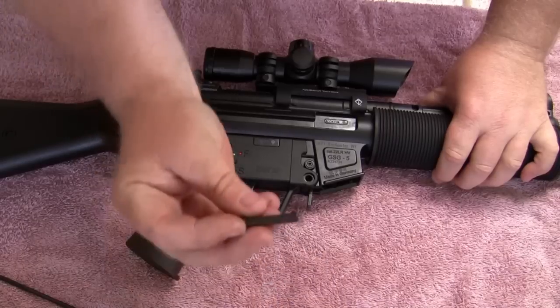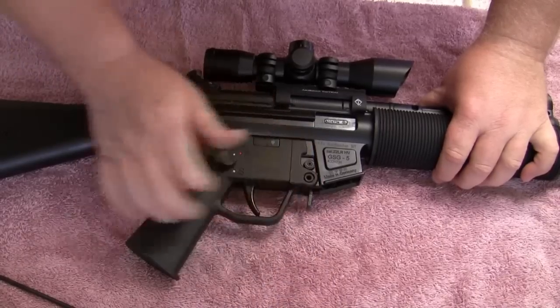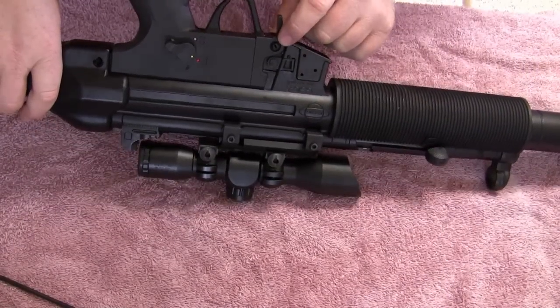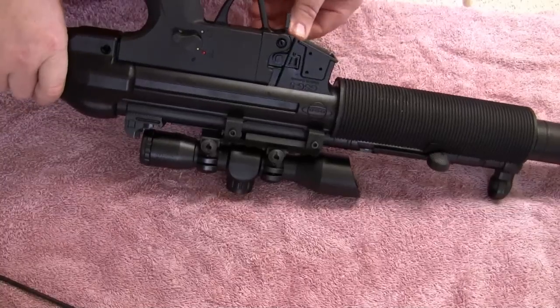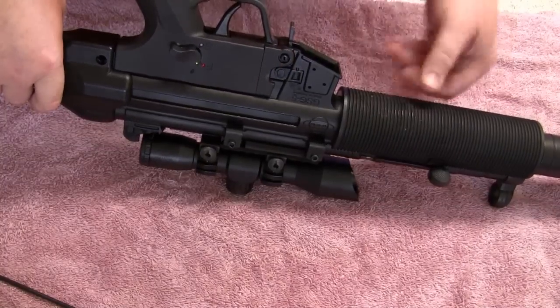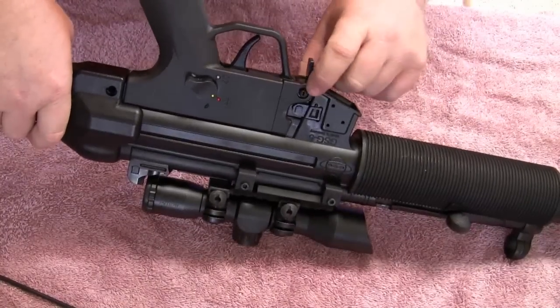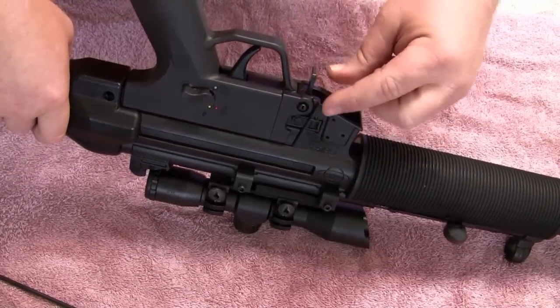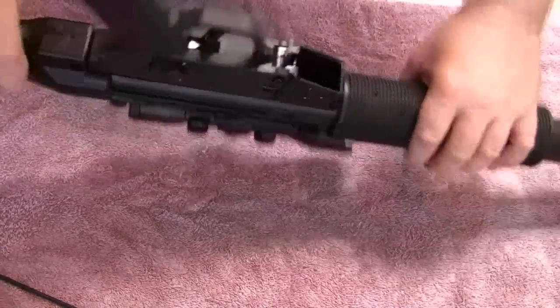Now the first one — I'm going to take the shorter one and push right through there. It sticks out a little farther than the old screw did, but that's good, that gives you that leeway. It can rattle a little — that's fine because it's not going to come out. The whole point is that it's holding that position in there. With the old set screw, if it came loose and rattled, the other pin could work its way out if you didn't notice.